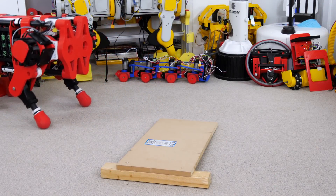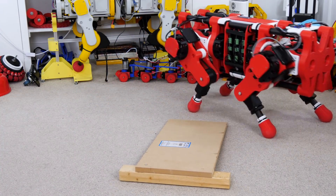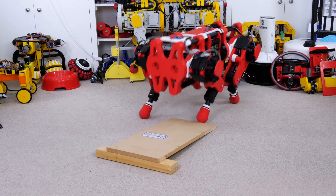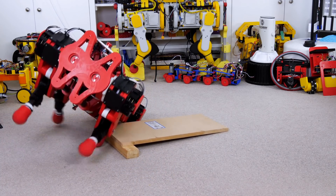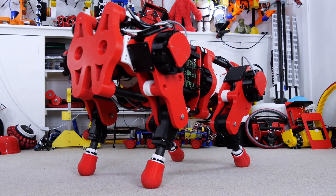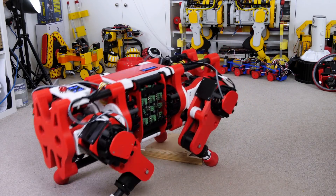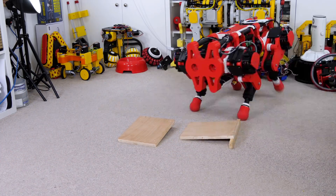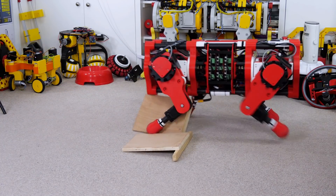With further tuning and scaling of the data we've got a pretty good response now. We can go over lumps and the robot doesn't reel around like it's drunk when stepping back onto the ground, stepping up onto an obstacle, or stepping off the edge even using multiple feet. Obviously there's a point where stepping off an edge causes a fall, but the motion is now pretty damped after one or two steps. I've also built in the pitch and roll axes already in the kinematic model, allowing the body to roll in pitch and roll — front to back and side to side. Using the same IMU data but mixing in those rotation axes along with the translation axis, it's pretty stable with damping on all of them, and it now pretty convincingly walks over most obstacles — nothing like it was before when it was rolling around drunk.